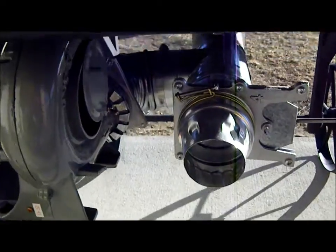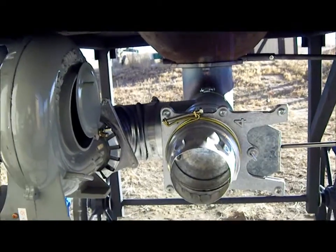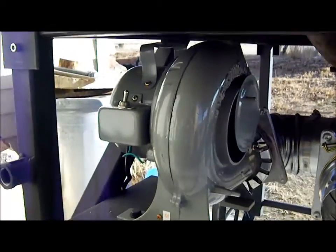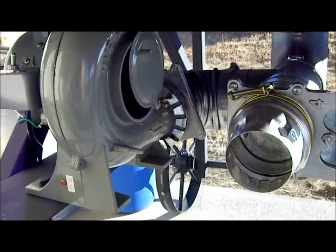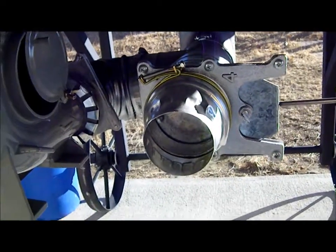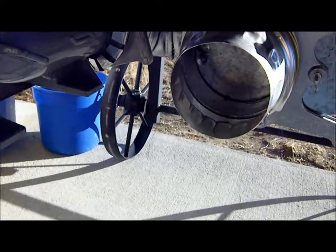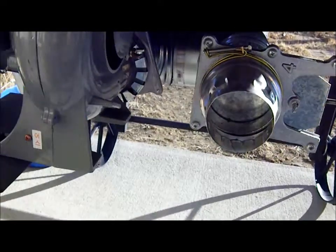So I have a hand crank, an antique hand crank blower. But I have the design here set up so I can use an electric fan, which I really like over the hand crank, particularly for coke. You really need a lot of air when you're running coke. And here's the plumbing that I have set up for the hand blower. Got a little handle here where I can open and close the vents to direct air from whatever source I'm using for a particular project.